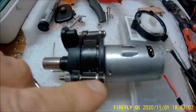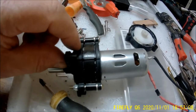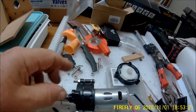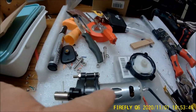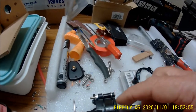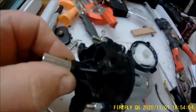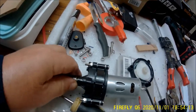I had to put in spacers here and here, because when you put the housings up tight together and tighten the securing set bolts, the housing seems to distort a bit and tighten up. Also, the cog on the motor with the stub shaft — if you go fully in, it jams against the stub shaft — so I put some washers there. I've put it back together now, tightened up, and added some 3mm nylock nuts as well, in case vibration would cause it to work loose.